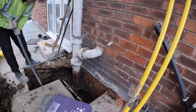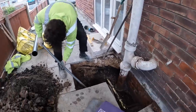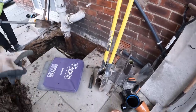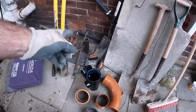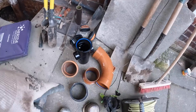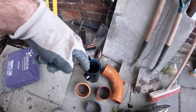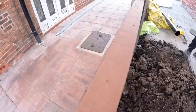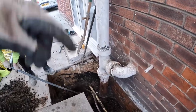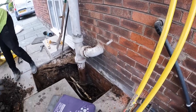Back from a supply run. The camera battery says 1% but it's still filming. There's the ingredients for soil pipe soup: there's our tee going into the wall, there's a Durgo valve that goes into the top of that, our sweep bend for the bottom, and either a 30 or 15 degree bend that goes into the clay and into the band seal. The Durgo valve just slips in and out so if it does ever need rodding from the top that can be done. The manhole's there so it can always be rodded back.